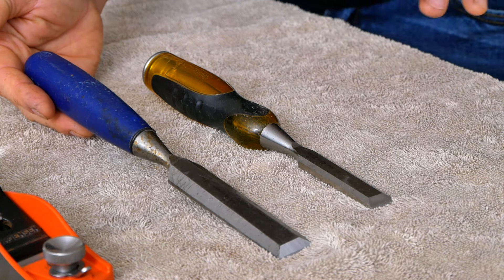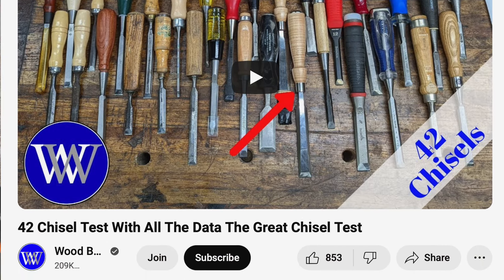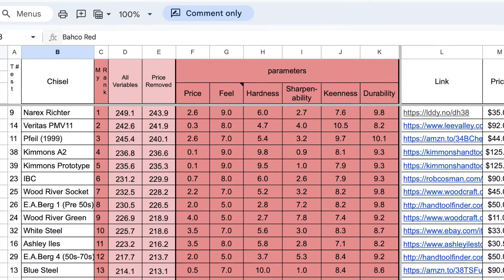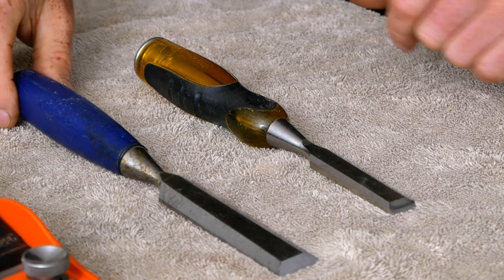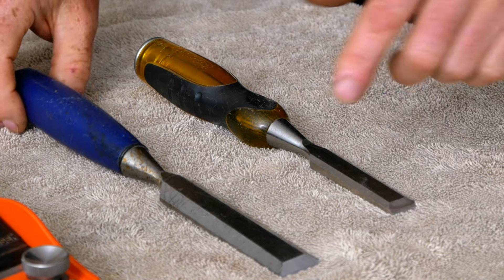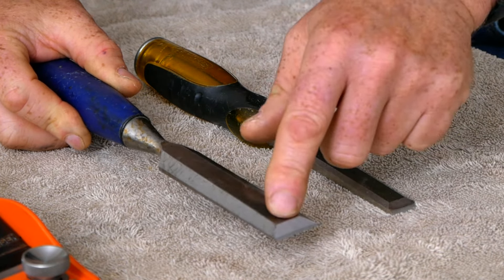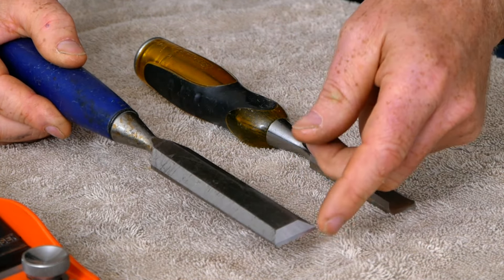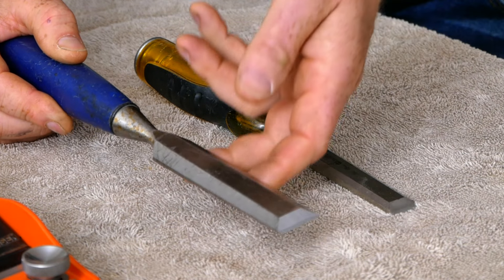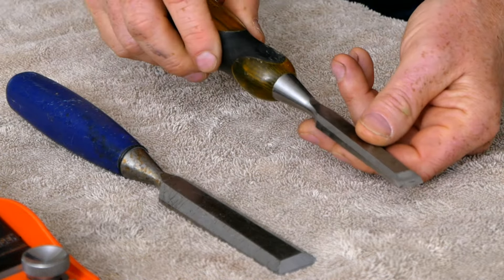I'm actually looking for an alternative recommendation for a good medium-quality comfortable chisel. I just found a great video on YouTube from a gentleman who did a scientific test on over 42 different chisels and generated an enormous spreadsheet with all these different variables. I'll put a link to that in the description below. As a general rule of thumb, for the average woodworker, what you're looking for is a medium-hardness chisel with a comfortable handle. If you get a really hard chisel it will hold its edge a lot longer, but it's going to be way harder to sharpen and more likely to chip on the blade — and it's a lot harder to fix a chipped chisel than to sharpen more often. On the other end, obviously you don't want a really soft chisel because then you're going to have to be constantly re-sharpening.